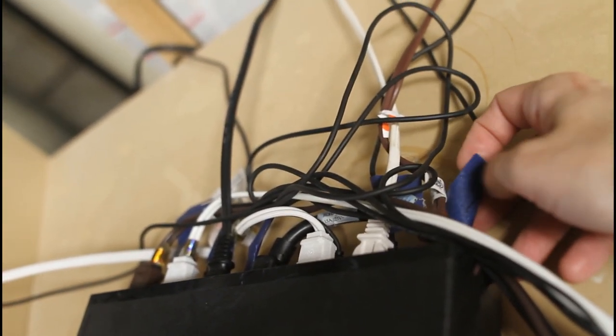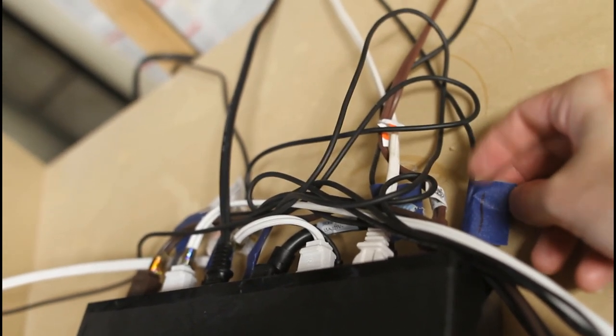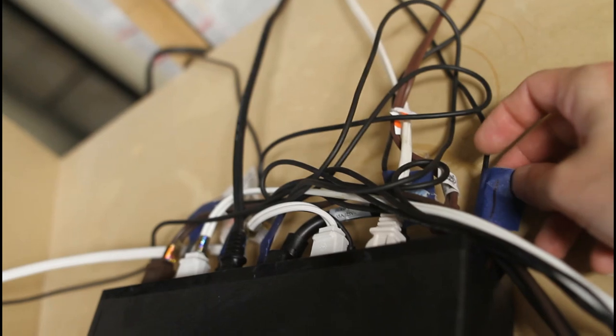So you can see one challenge with having all these wires is that the organization can get quite complicated. If you see here, I have these tape labels, and I've labeled what channel each one goes into on these probes. Actually, I didn't do that for these plugs that plug into the heat tape, but I would recommend that you do that as well, just to avoid confusion. And then clearly label every shelf on the rack where you have the device that corresponds to that particular channel. So now we'll look at the interface of the herpstat.